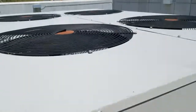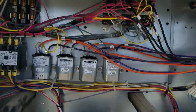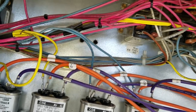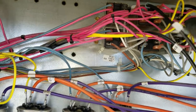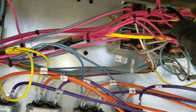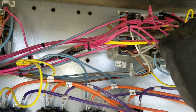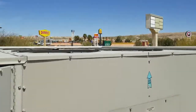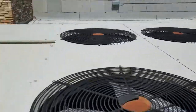The unit's not running right now, but condenser fan motors are a big thing that fail all the time. So what I'm gonna do is bypass the condenser fan motors just to verify if they're working. These older units have relays that make it possible for that to happen, so I'm going to the other terminal to force on all the condenser fan motors as a preventative measure.